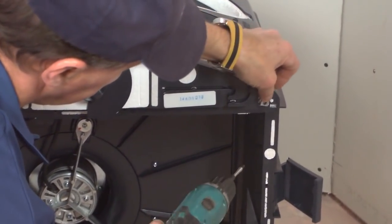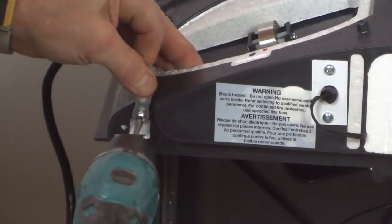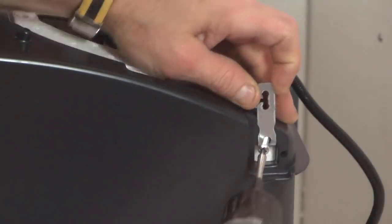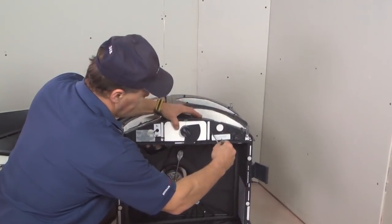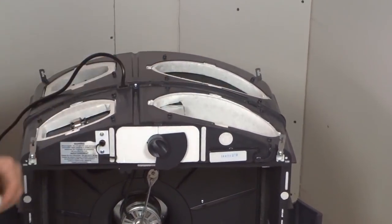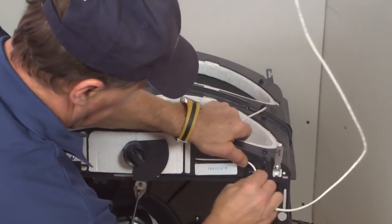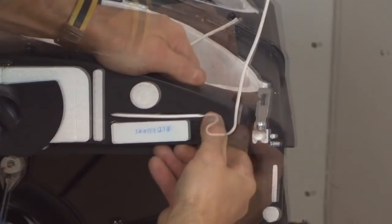Assemble the four hooks on the unit. Carefully punch out the hole for the wall control wire in front of the unit. Insert a small length of the wall control wire into the unit through this hole, then route the wire through its front channel.